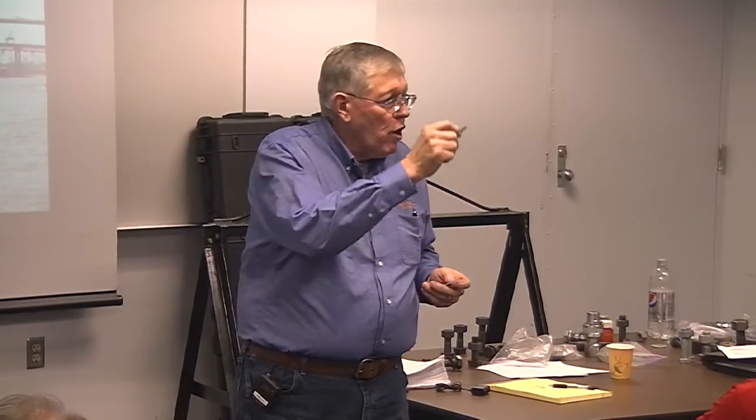Let me approach this a little bit differently. We're doing the turn of the nut method. You're supposed to snug, go through a second time and snug everything, make sure everything's right, then you match mark, and then you hit everything with a gun, a third of a turn or a half a turn, whatever is required. But let's say during your inspection you apply an inspection torque and you find some loose bolts.